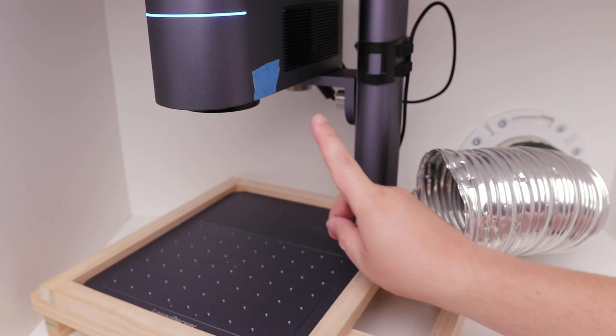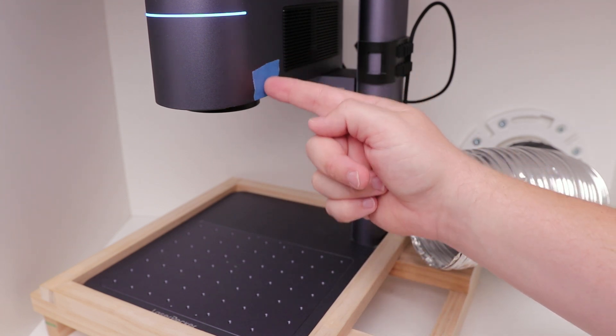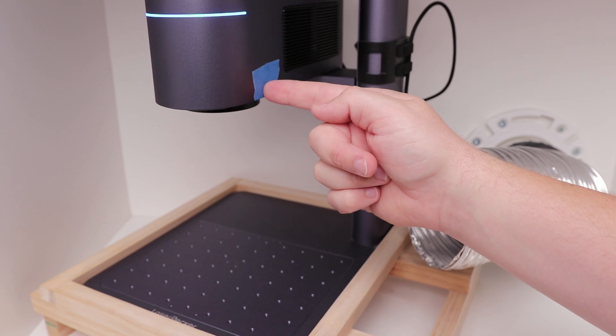The second test we're going to do is lay a piece of material, set the focus at different distances, and run a line across, then compare the thicknesses of the lines. We're going to be measuring from the bottom of the laser enclosure and looking for where the center of the thinnest area is.